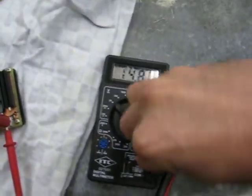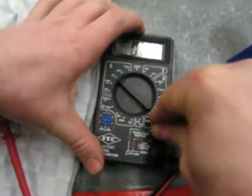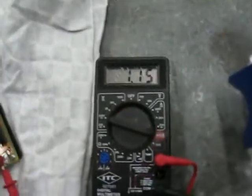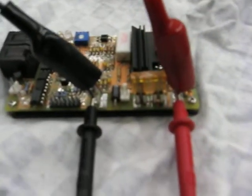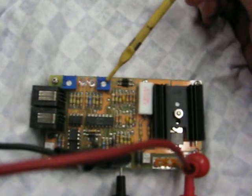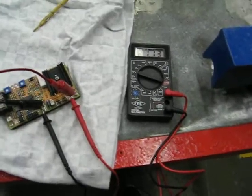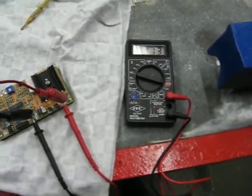Let's stick this in the amp port. There's amps — so 14.8 volts and we're at 1.14 amps. We're not going to hurt anything, and we've got those clamped on to the battery positive and minus. We just want to adjust the set point — that's this guy right there — and it looks like 14.8 is already written on there. We were kind of test charging the batteries and it didn't look like the reg boards might have been all set at exactly the right point, so let's check them all and make sure everything's good.